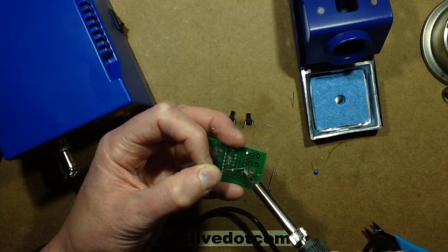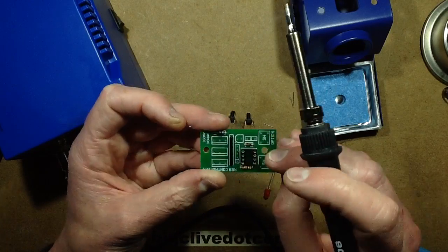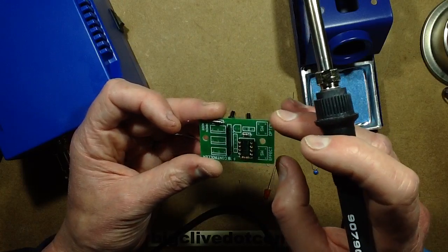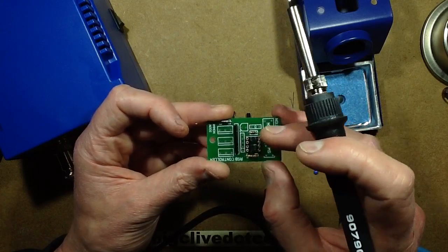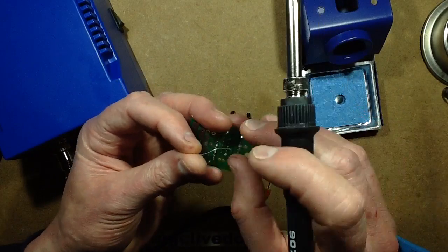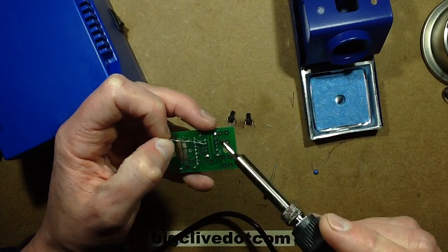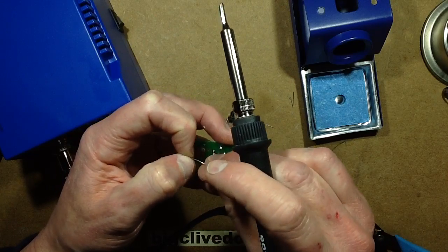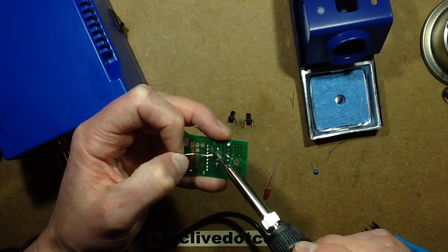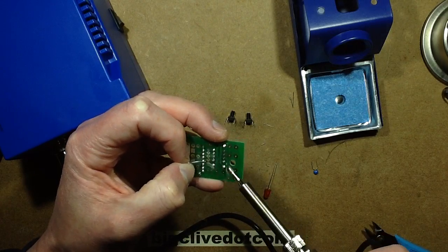So I'm soldering this socket. Someone was also asking about the socket, because the ones I use have the little round pins, receptacles in the top. These are what are called turned pin sockets. They're more expensive than the traditional flat blade sockets, but they're just so much better quality. The kits I tend to always use these now. Initially with this kit I shipped it out with the flat terminals, but latterly decided, nah, you know what, turned pin all the way, it's just a better quality thing.